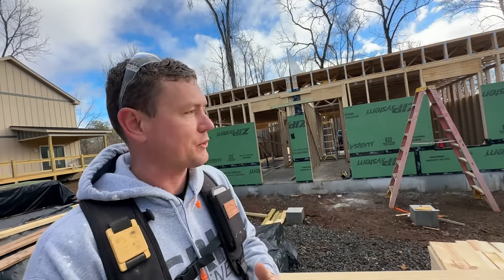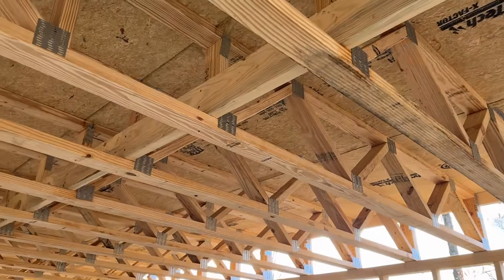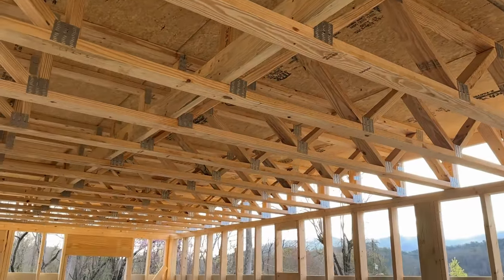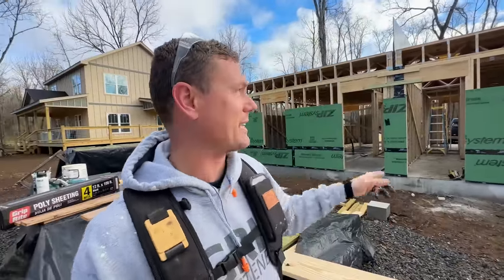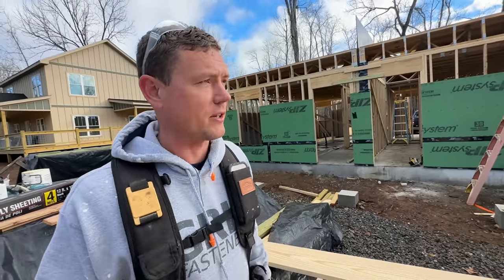It's really nice actually having that space because I don't know of any other floor system type that you can do that and interconnect them perpendicularly in the center of the span. Perpendicular? Perpendicular. So I really like that. As a matter of fact, you could go nuts and put like a LAM beam in there or a double, triple layered. Yeah, you can really stiffen the floor system, your joists and stuff. So yeah, I think it's awesome.